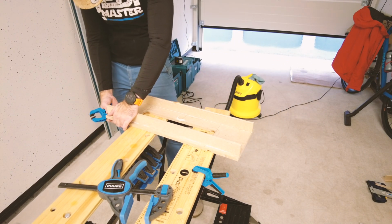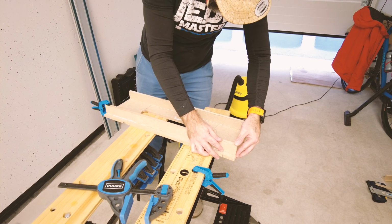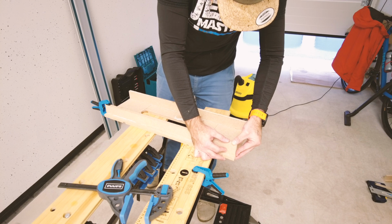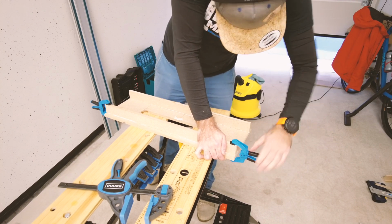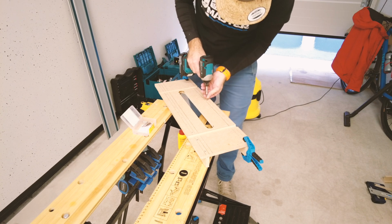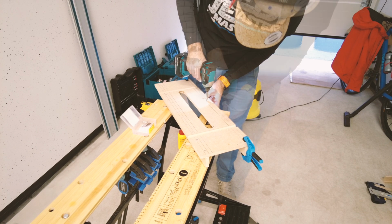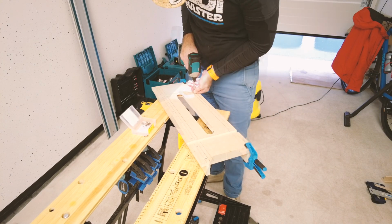The reason to use vertical fences here instead of just mounting them horizontally is so that they add strength to the sledge. And what I mean with this is that by placing the fences in a vertical position, the sledge will have a lot of resistance to torsion. And torsion is what is going to make a cut uneven.